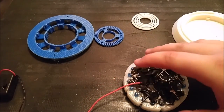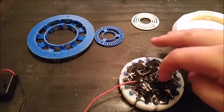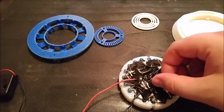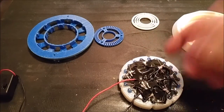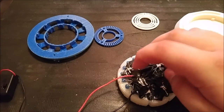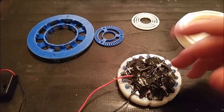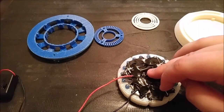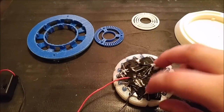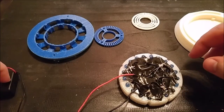Unfortunately I'm going to have to just explain it because I can't really open it up to show you. Essentially I put all of them in — there's some in the middle as well, not too many, but a few. I put all the LEDs in, found the positive lead and bent them down. I didn't touch the negative leads because I put them all down and then I soldered them all together. Then I took this electrical tape and totally covered them because I don't want the positive and negative leads to get crossed at all. So then I bent down all the negative leads and soldered them all together — you can see that right here.